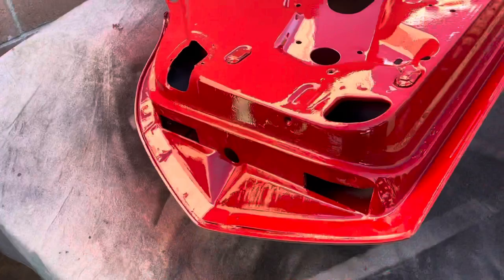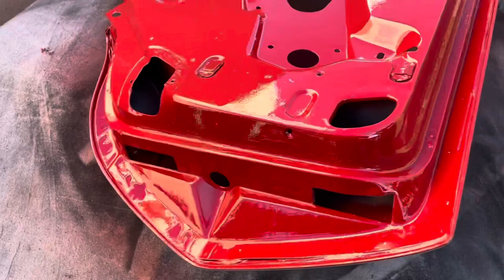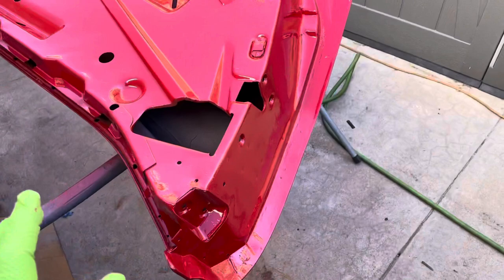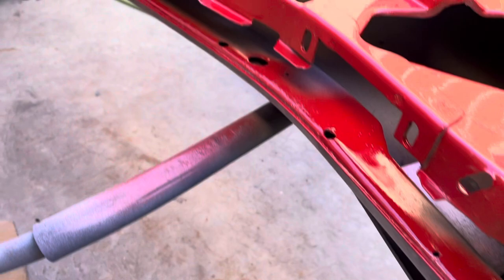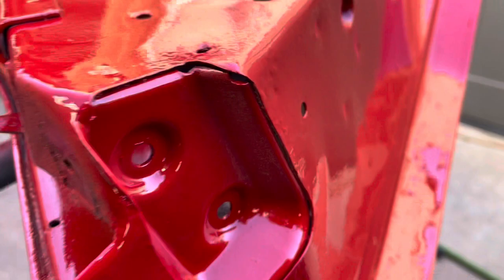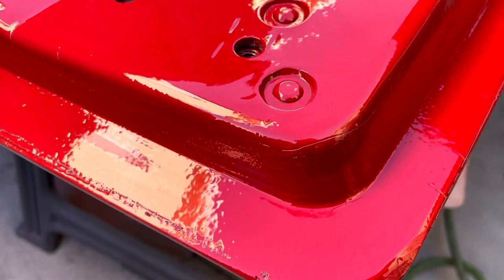It says to do two or three medium coats. If it doesn't get those little separation dots - I don't know what that's about - but this is what it looks like right now. I don't see any of those little white dots, but they could form. Hopefully not. This is just roughly primered, wasn't sanded or anything. It's kind of hard to get everywhere in here - you have to get every little angle because the paint doesn't just find the metal. It's pretty directional. I see I missed this little crack here - I had a few hairline cracks. It's old machinery.